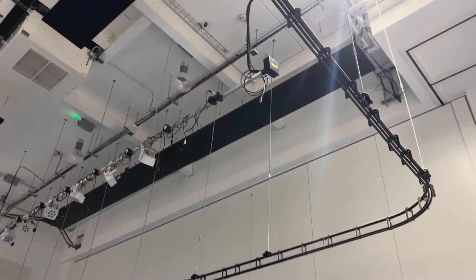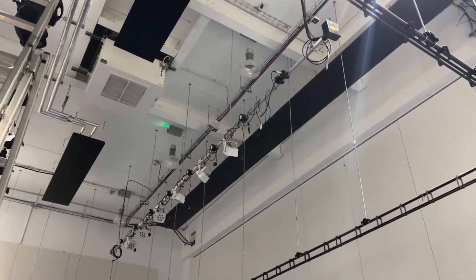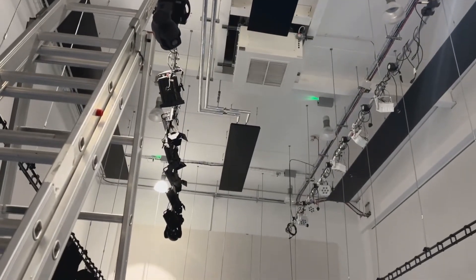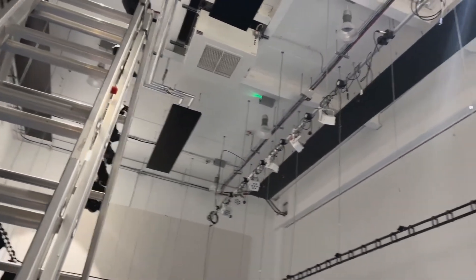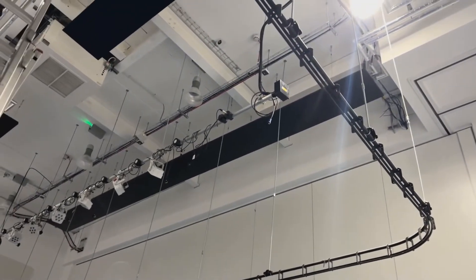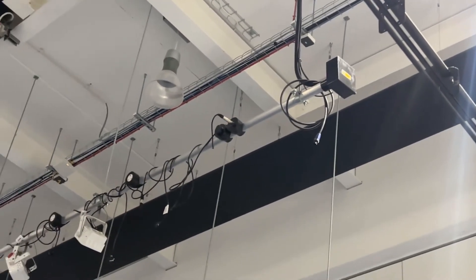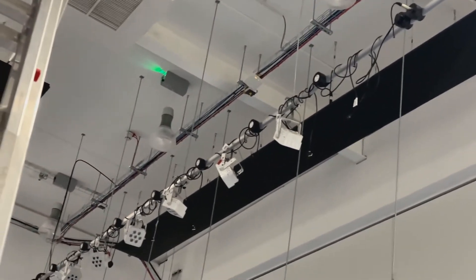In the studio we can see the lighting bars. The lighting bar on the right has lights that need fixed power, and the lighting bar on the left has a mixture of moving lights needing fixed power and standard incandescent lights using standard dimmer power. The wires from the dimmer rack come into the end box on the end of this internally wired lighting bar and run along the inside of the pole to each individual socket. When we do our testing, we're testing all the way to these individual sockets from the dimmer rack.